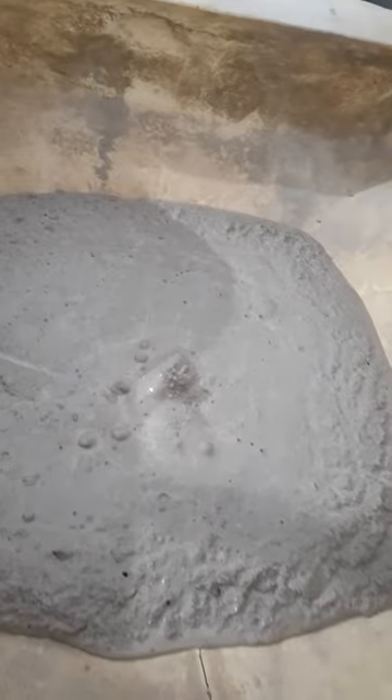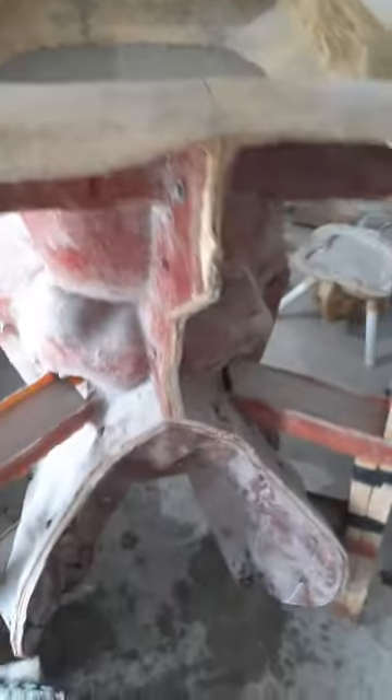This vibration is used to create thousands of small little holes throughout the statue. It's called air entraining. We put a chemical in — you see those little bubbles popping there — and the whole idea is to allow it to be winterized. So we can drop down to minus 40 and the statue won't break or crack or anything like that.